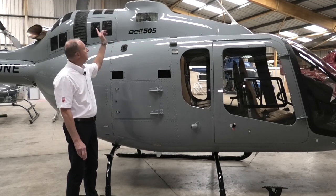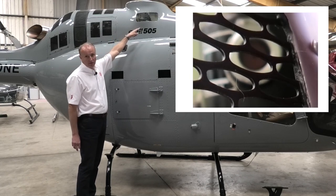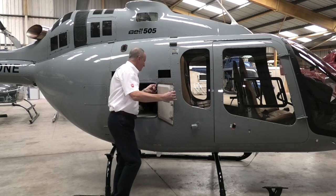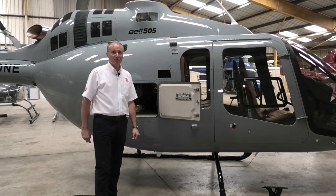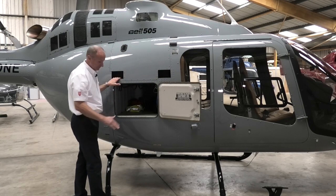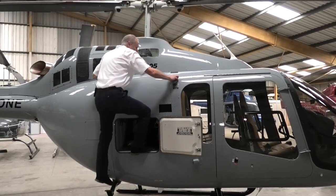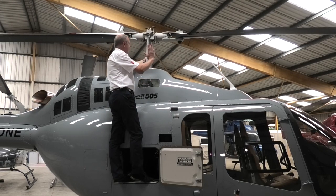Next item to check is the rotor head and the main rotor blades. On the way up we're going to look at the hydraulic oil, which is seen through this grill here — you can see in the inset it is at the correct level. The aircraft is designed for you to climb up the side. There's a pin in the boot which could cause the door to open, so we have a handhold here, a handhold here, two foot places here, another one on the lower cross tube, and it is designed for you to stand on the boot floor. Always hold the mast when you climb up, not the pitch links, because the pitch links are designed for vertical load, not horizontal.